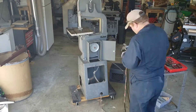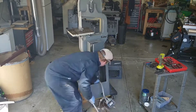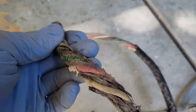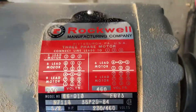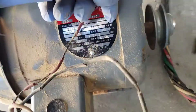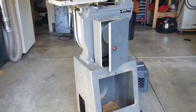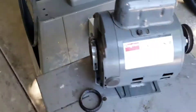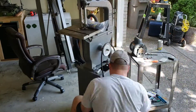Taking off the starter switches — there's a lot of stuff that looks like it was added afterwards just because this is an industrial style machine, they made it fit. There's all the wiring. Those are your starter boxes, relays. That's what the power cord looked like and that's also the inside — that's going right to the motor. So if you guys have old equipment, check the wiring. This is also a really good reminder why you should always unplug your equipment when you're done with it. It's just going to take one of those hot wires to touch a metal part of that box or part of that machine and start a fire and your whole shop goes up in smoke.